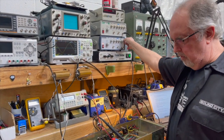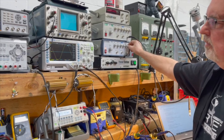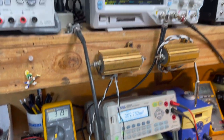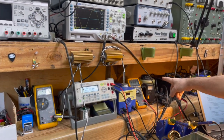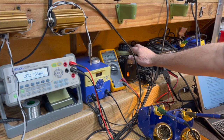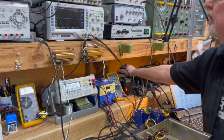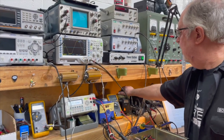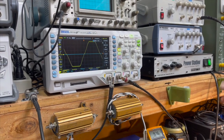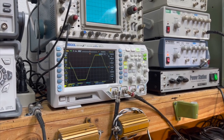All right. That's that. So, now, let's run it back up to our 32 volts, which is 130 watts, right there. We've got a little bit of loss through the variac, which is operating right now, and it was set to 119, and we're down a little more than 2 volts. Now we variac it down to where we were at with the deliverance at 98. And that's right before the relays were starting to give up the ghost a little bit. Not the relays, the regulators. Right, right.